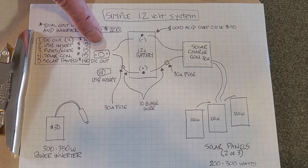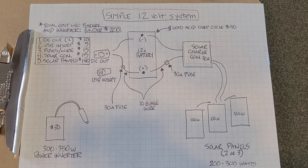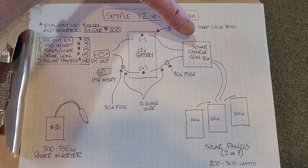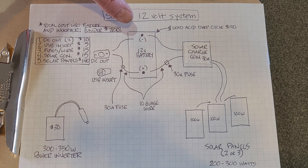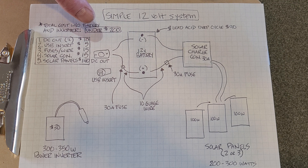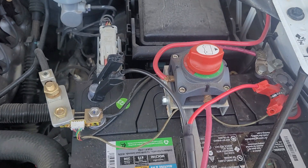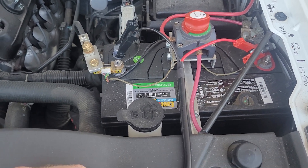On the output side, you have your DC out — a cigarette lighter socket — and also a USB port. Between those two, you can charge your battery, especially during the day when you're pulling 6 to 10 amps from the panels, which is ideal for keeping the battery charged. You can charge your devices during the day since you'll be bringing in 10 to 11 amps and only drawing maybe 6 or 7 to charge devices. Even a standard 12-volt car starter battery won't be damaged because you're not net-discharging it. This is all you need — some clamps to connect to a deep cycle or car battery.